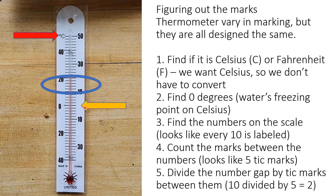When you find a thermometer, locate zero — this one goes both positive and negative. Then look at the markings: every 10 degrees are labeled, and you count the little tick marks in between. This one has four tick marks between labeled values, which means five steps, so each mark represents two degrees. For example, if the liquid is two marks above the 10, that's two times two equals four, so that would be 14 degrees Celsius.